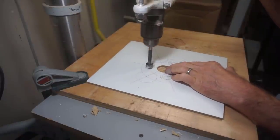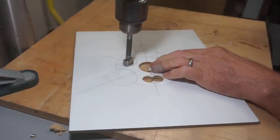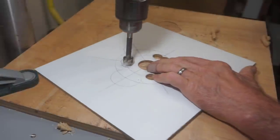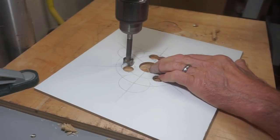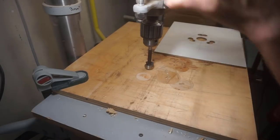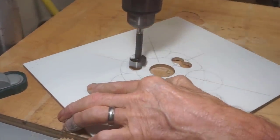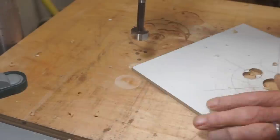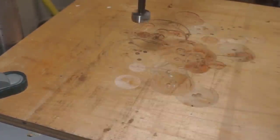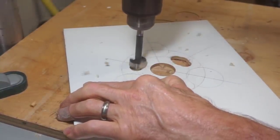After that, I follow with six holes three-quarter inches in diameter for the sides of the oval bottle holes. Using Forstner bits and a drill press like this makes super quick work of making very accurate holes in a small template. Since the center point is gone for those holes, I carefully line up the outside diameter of the bit with the drawn circle — something you can only do with Forstner-style bits. Forstner bits are designed with a sharp rim for guiding holes drilled just like this, which is another reason they're so useful because they don't need to rely on the pilot point for partial holes.